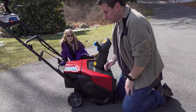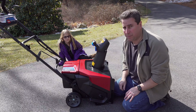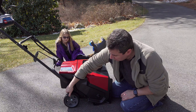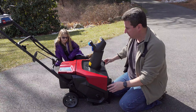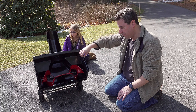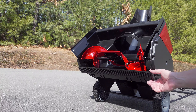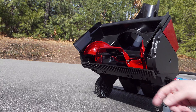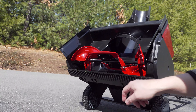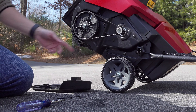The things I found most different about the Toro are the build quality. The plastics are definitely better made — doors and everything seem pretty solid. Toro's been making these forever; they've had two-stroke and four-stroke versions of this style machine for ages. These are real rubber tires, which is pretty unusual on a machine like this, and even the impeller is actually metal, as are the sides. One of the biggest reasons to buy a machine like this is there's really no maintenance. The only thing you'd ever have to do is replace the scraper bar at the bottom — it's just a couple of screws. There is a belt inside the cover but again it's just a few screws and it can be changed pretty easily.